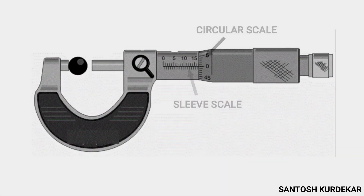The last part of the screw gauge is the scales. Micrometer screw gauges come with two scales: one rotating scale found on the rotating cylindrical part, also called the circular scale, and another found on the stationary sleeve, called the main scale or sleeve scale. Some designs of the instrument can also have a vernier scale.